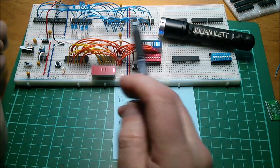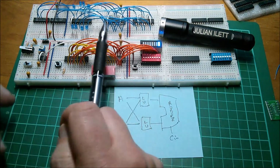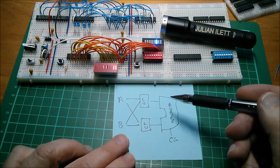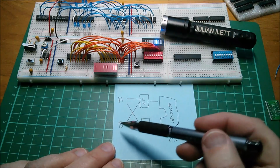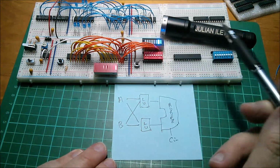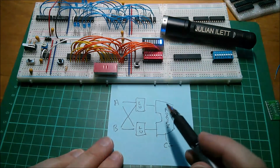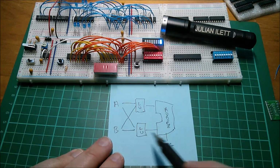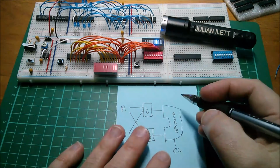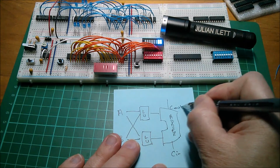Now these were my two 1-bit shift registers. I think one is a shift left and one is a shift right. Don't need the shift left because that is a multiply by 2, which we can do by simply adding A to itself or adding B to itself through the adder. So I can get rid of one of these, keep the right shift, and then right shift will go through a special purpose register. Most other arithmetic and logic calculations will go through the ALU. If you get an overflow from here, of course you've got a carry out.